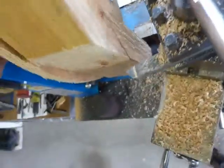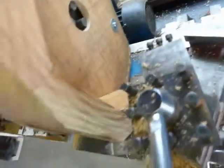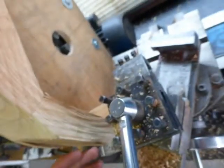Look at that, it's actually working. I got to change the tool bit again because this one seems to be treating it better. And also I noticed when cutting this piece in particular, it really wasn't liking the in to out feed, because that's kind of like splitting it apart. If you push it in this way, it's like pushing them together, because that's kind of how the woods were oriented. So yeah, we'll keep doing this.